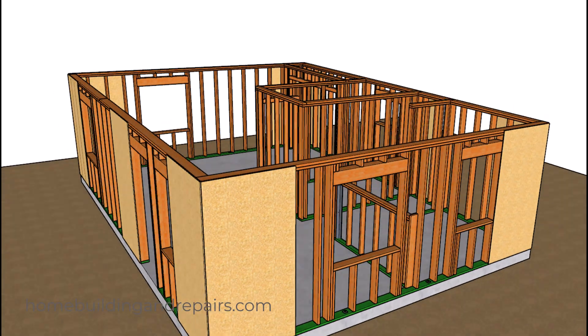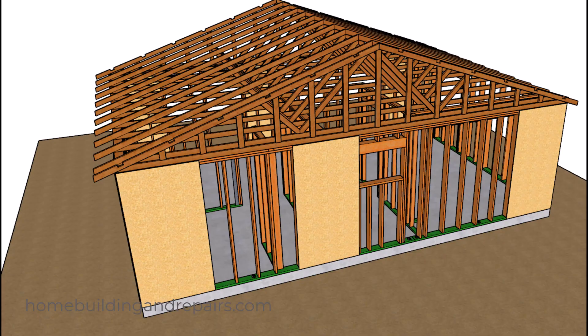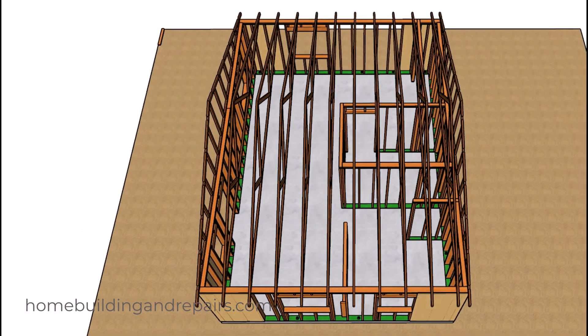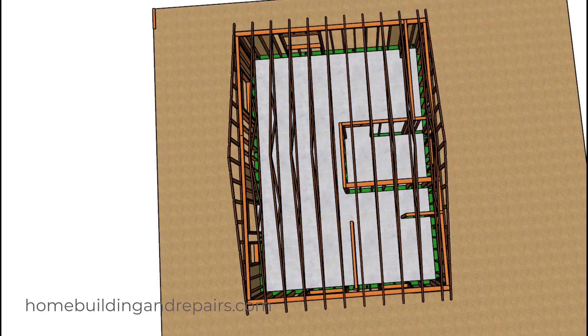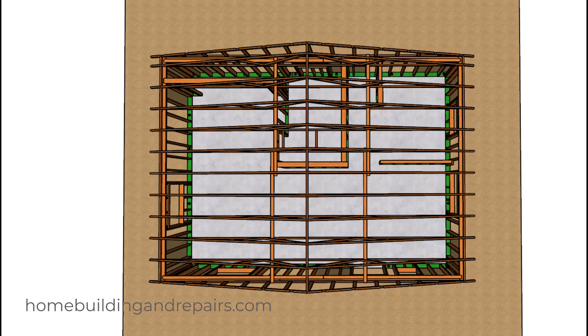In this video we will go over the roof framing, and this is going to involve roof trusses. Even though I would have changed the direction on the roof trusses, I understand because the gable is going to be located at the front door. But if you would have changed the direction of the roof trusses it probably could have saved you a few dollars, since the trusses wouldn't have used as much lumber. So if you are going to build a house like this and you don't need the gable wall at the front door, consider that option.